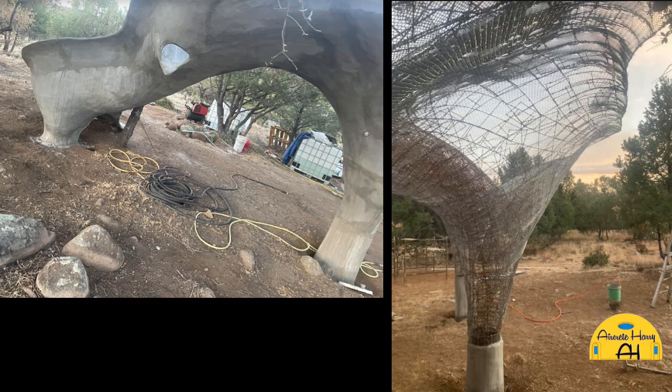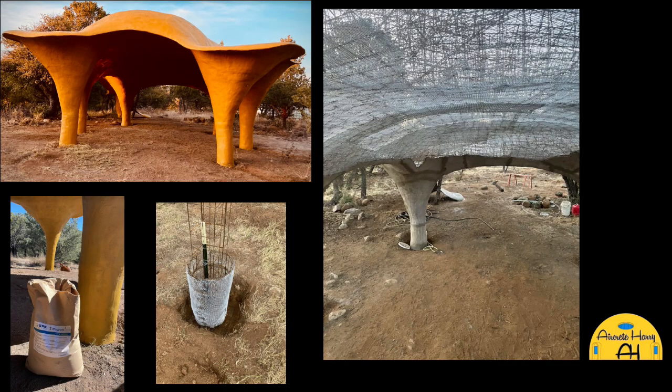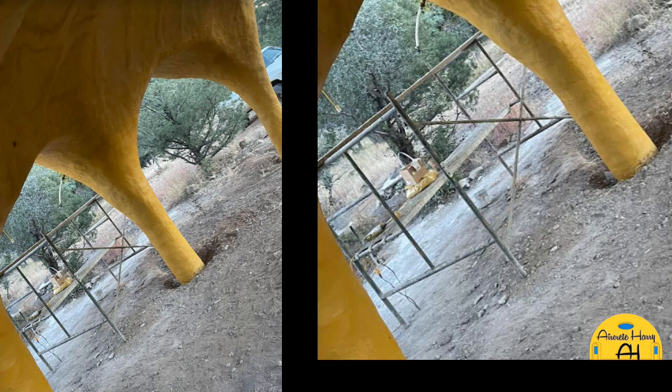And then at 5.5 feet, which is eyeball face level, it'll blend to the other curves that are needed in each direction. That approach simply allows you to have good head and shoulder clearance around your columns when you have your finished floor height. So it's something good to pay attention to. And it helps you ensure that your entry archways have enough height that you can just install a very basic door frame in each one.